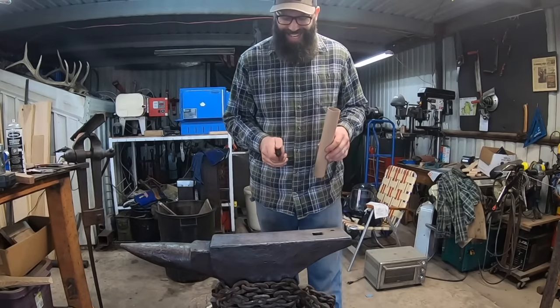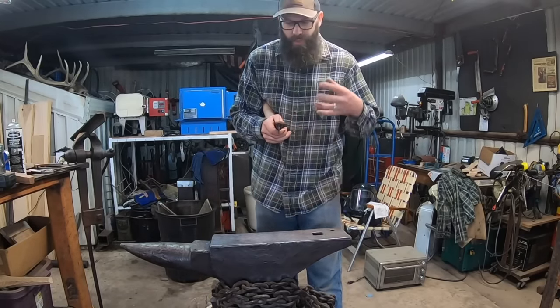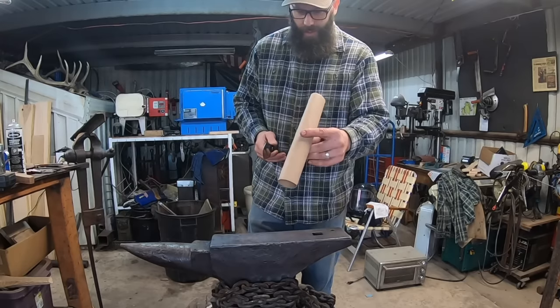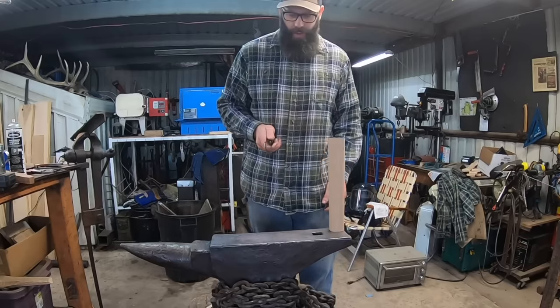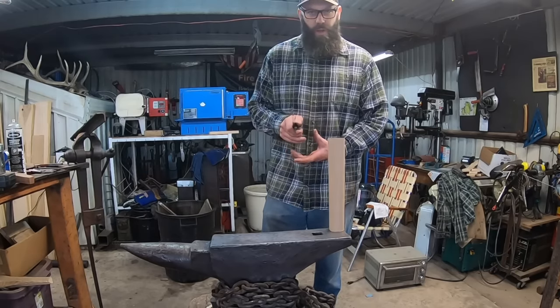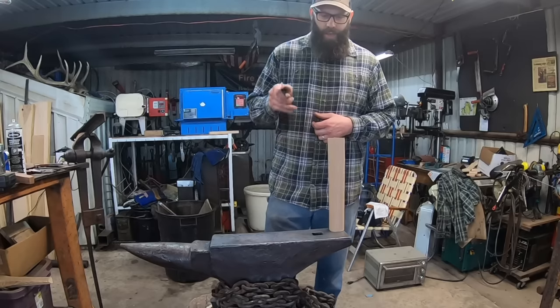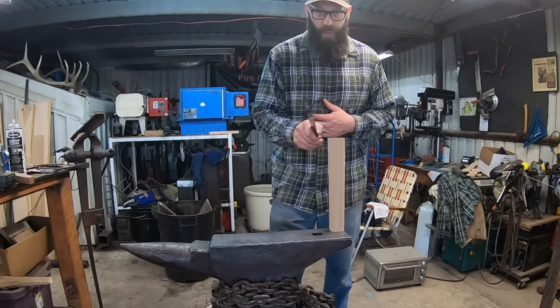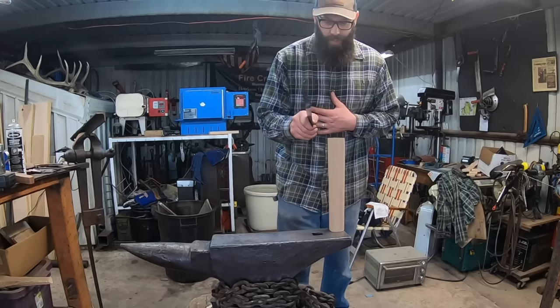Despite the fact this is not the knife I set out to create, it still turned out pretty cool, and I'm going to show you pictures of it in just a second — but first a cut test. If you've enjoyed this video don't forget to leave a comment, subscribe, all that great stuff. We have a sharp, slicey knife — this long thin angle is going to be great for slicing through barbecue. I've got a paper towel tube here and we'll set it up on the corner of the anvil. This tests two things: the sharpness of the edge but also the cutting clearance — the thinner your knife is overall, the better it should perform in cutting.